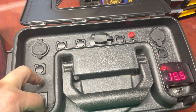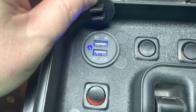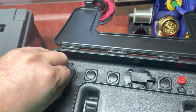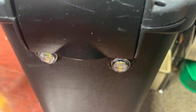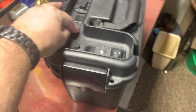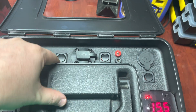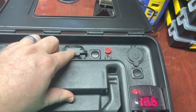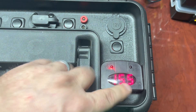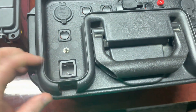This powers the standard 2.1 amp USB ports. I did put on a couple of little LED floodlights, so those are on that switch — I need to label all these but I know what they are. This switch runs my SAE port, this switch is for the banana jacks, that switch is for the 12 volt, and then this little toggle switch is for the volt meter.